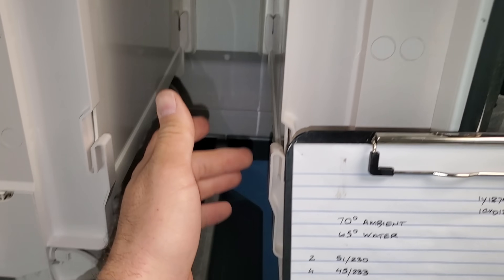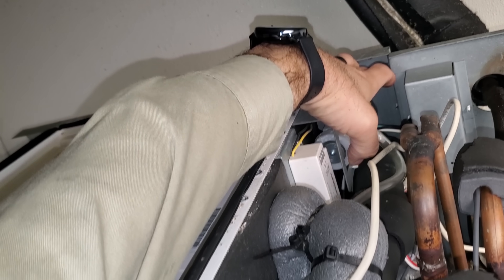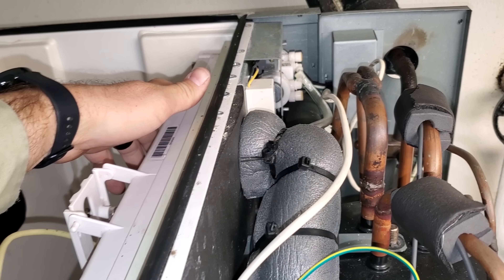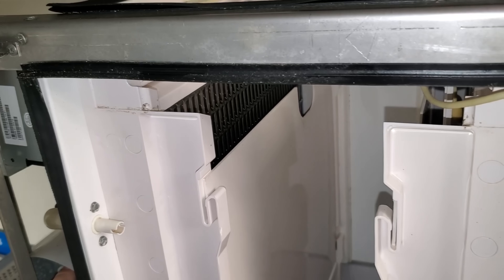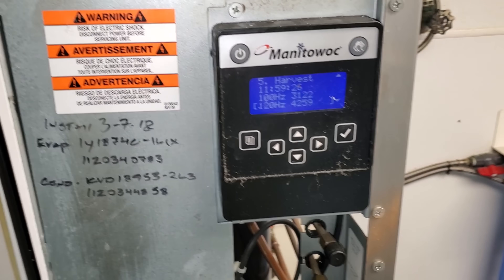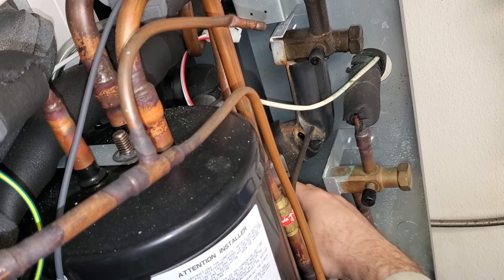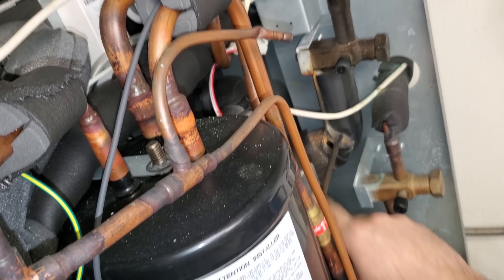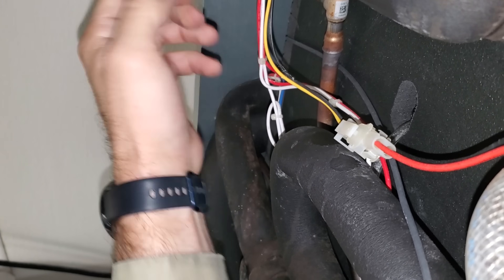It's harvesting right now. We got all our numbers written down. After the right side dropped, the air pump turned off for the left side — that's kind of weird. The air pump is still running for the right side; there's something funky here — a wiring issue. The air pump is still running for the right side, but the ice dropped off the right side, and it's not running for the left side anymore. I wonder if the vapor valves got mixed up.